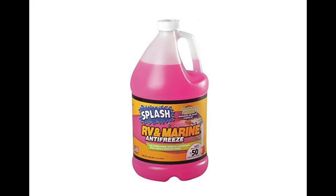Once we were finished with blowing all the air out, we poured antifreeze for an RV down all of the drains so they were in the traps. There was three sinks, two toilets, and one tub and one shower. All of those were pushed with the special antifreeze.